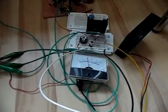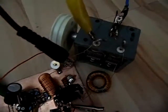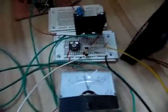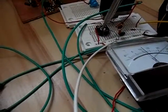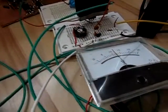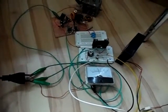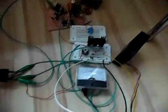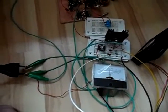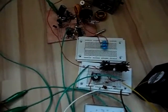I'll be brave and increase the voltage a little bit more. My concern is that the insulation from the wire can take the high voltage. I'm going up to 11 volts with this circuit. Now I'm on 11 volts and I will recalculate the power. I'm seeing around 550 to 600 milliamps - I think it's five and a half watts now. Five and a half watts on the antenna.